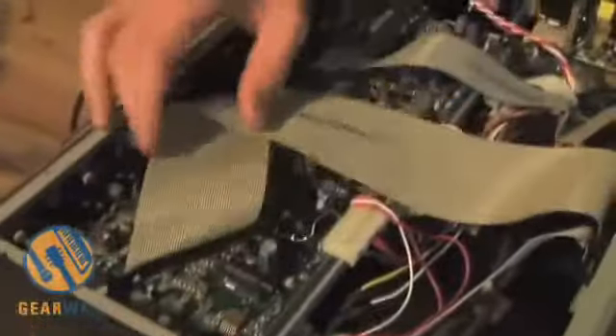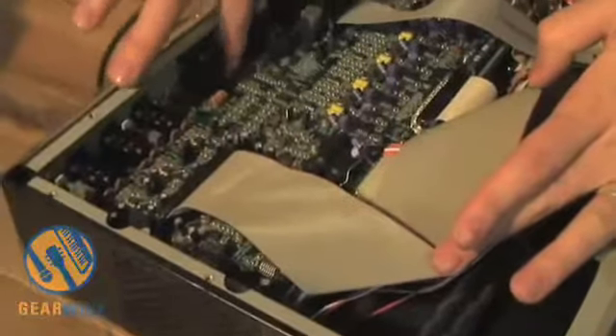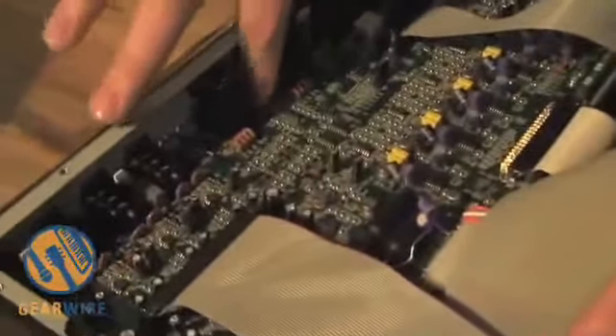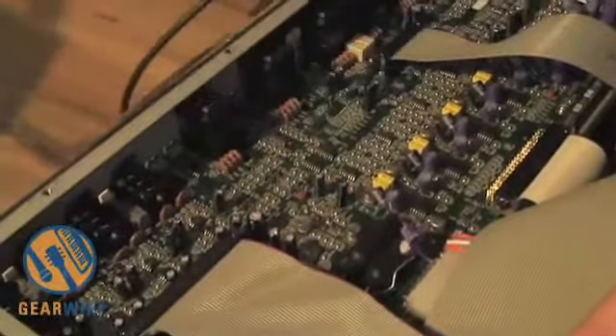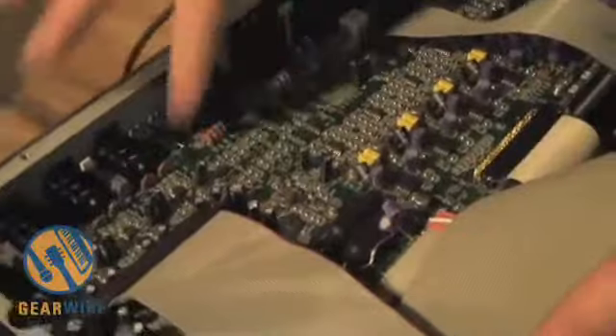Now typically with these, if we add the power supply, we don't really mess with this. But if we don't add the power supply, we actually RF shield these cables with a foil. This reduces stray noise that tends to get picked up in these sections. And if you've ever turned on your 002 and armed tracks like 5, 6, 7, and 8 and heard that little whiny noise — that's what that is.